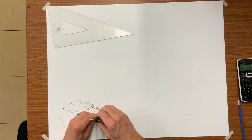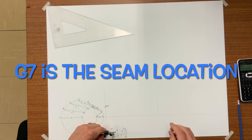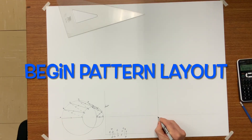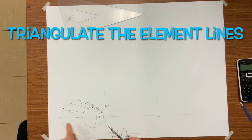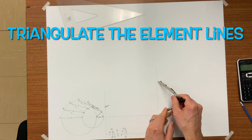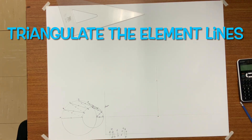Now the last one to transfer is G7, which is going to be the seam. Now we are ready to start our pattern and I'm going to start at the letter A. Looking at our directional arrow, we want to find point 1. Go to the baseline where you located A1, and set your compass from A1 to the 4-inch height. You have now triangulated your line — that is point 1.